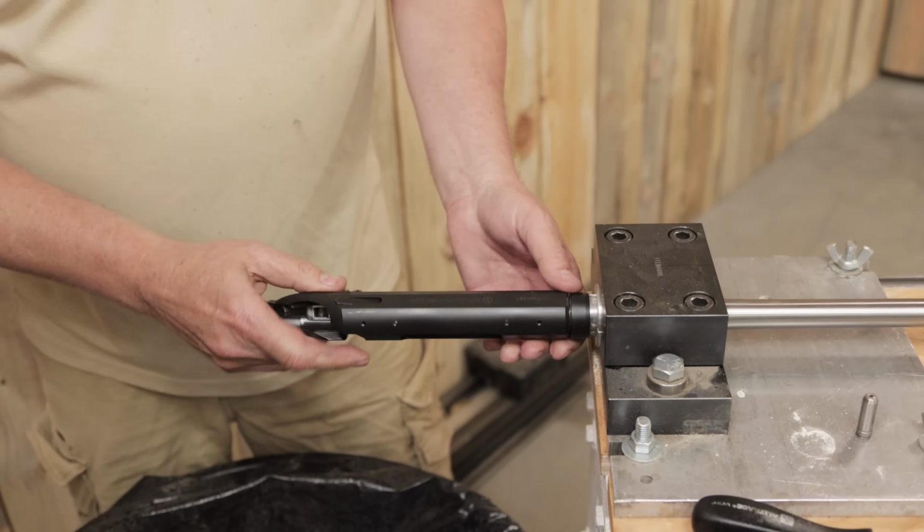They set it to about 130 thousandths, meaning that the go gauge is protruding about 130 thousandths out of the back of the barrel. So that makes it very easy for us to headspace on the lathe, because you don't even have to bring the action over and test it. You just cut until the headspace gauge is at 130, and then when you go to assemble everything, you use the barrel and the nut and the action to make all those settings.